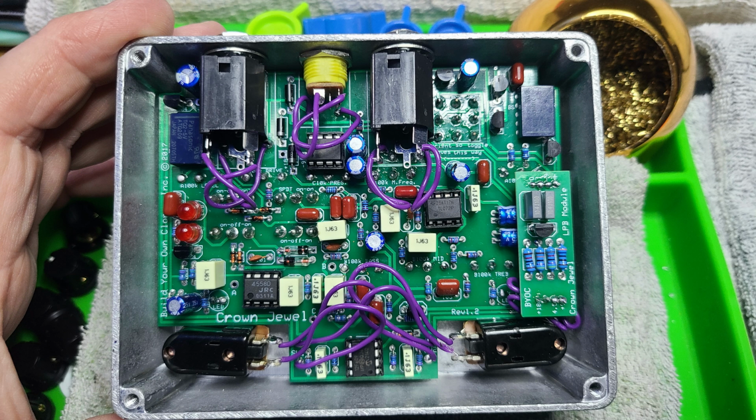And so when it went through the circuit board and it got soldered and everything was accurate, there are 2 potentiometers that were in this kit. And if I'm not mistaken, it is the presence and the drive. Yeah, the presence and the drive didn't have any protection on the back of the potentiometers. So they are bare metal. And once everything was cinched into the case, the wires were actually touching on the presence and the drive. That is, the input and output wires were touching the presence and the drive, just because there's so little space inside of this box. I mean, it is insanely crowded.